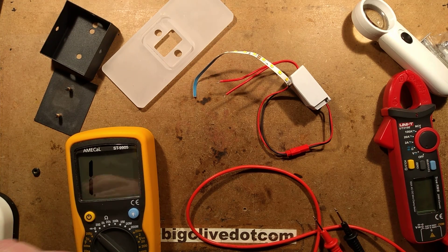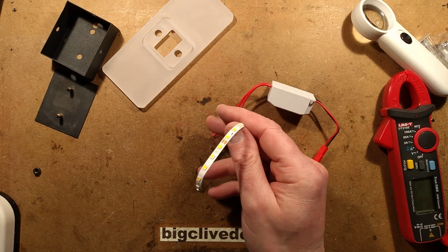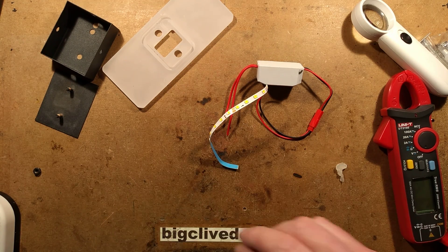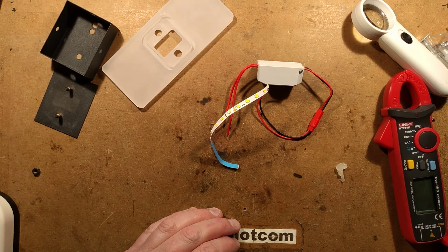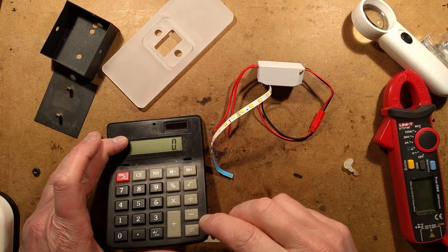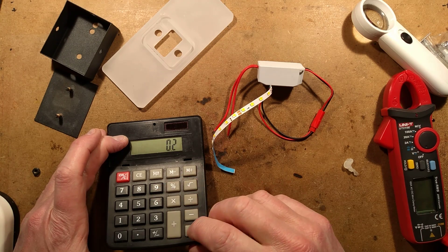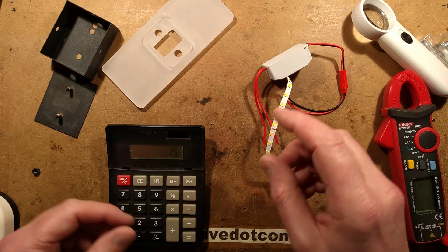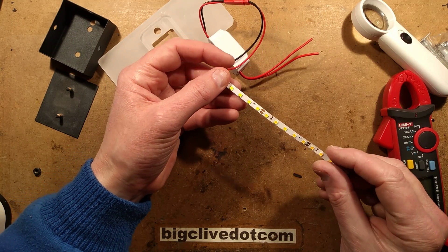For adapting it for your own use with low-voltage stuff — that LED tape is about 9 volts for that loop. All you need to do, if you wanted to run it off 12 volts, is put a resistor in series. What would the value be? If you want to run it at the same current — 200 milliamps — R = V / I, which is the voltage to drop from 12 volts: 3 divided by 0.2 equals 15 ohms. You could also use a higher-value resistor to run it at lower current, particularly if you're using it in a trailer where you just want a low-intensity visual effect for night illumination.